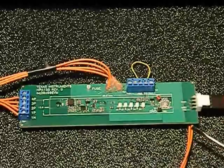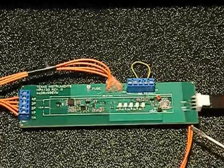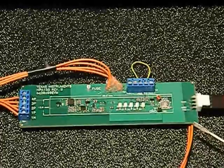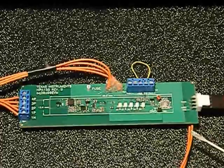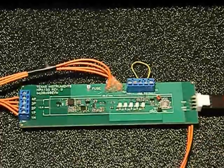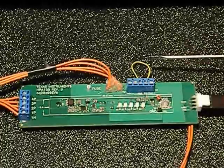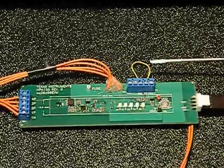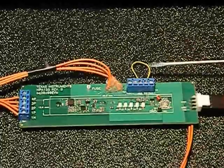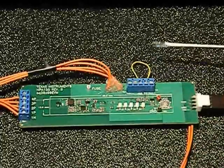These wires right here make a connection to the back side of the board where the sensor resistor is located. We've actually removed that sensor resistor and placed two leads on there which go to our current sensor simulator, which is just an analog voltage output proportional to current. This connector at the top is a connection which would run outside the battery pack and loop back to tell the BMS that it is connected inside the battery pack to an external system like a laptop or portable electronic device.